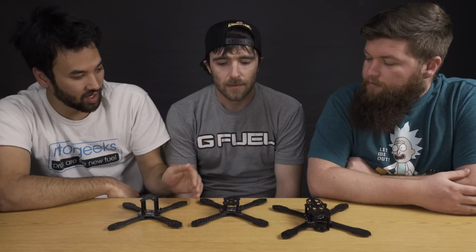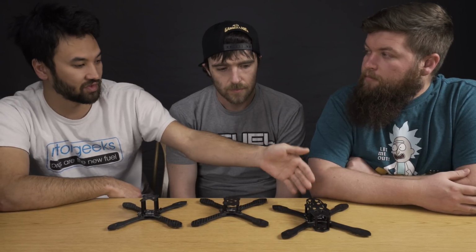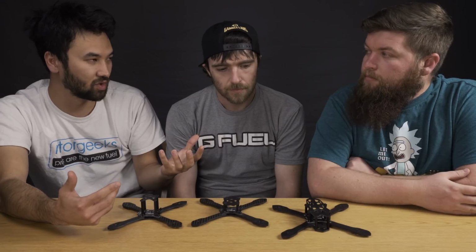So once again, this applies for the most part to other quads. If you want to do racing, a bottom-mounted battery is beneficial because of that flexibility. If you're doing more freestyle GoPro stuff, a top-mounted battery just seems more smooth. So if you're shopping for a frame, take those into consideration. That, and the maximum tilt on this guy with the 3D mounts we have on our site is only about 30 degrees. So we knew that coming in. We can probably get more tilt out of it if we need, but it was originally intended to be a filming platform.